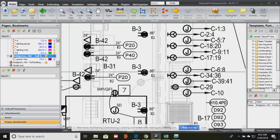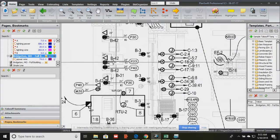But what they do provide for, even for telephone, televisions, all of that, the electrician provides a junction box and conduit that will take their wire from the box itself to just above the ceiling to kind of hide the wire. But from that point on, the telephone professional, TV person, whatever, takes their wire and runs it from that point on. Okay, so the electrician, again, only provides junction boxes and conduit for anything related to data, communications, telephone, closed-circuit TV, anything like that. Okay, so the electrician knows, okay, I see some of these, so that's junction box only plus conduit. So that symbol basically means that to the electrician.